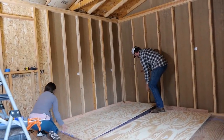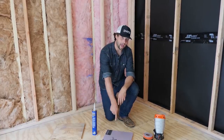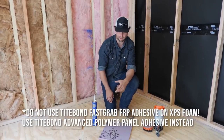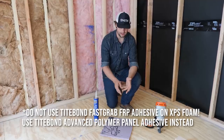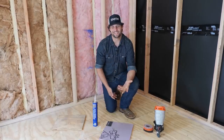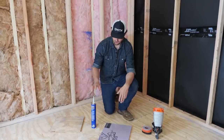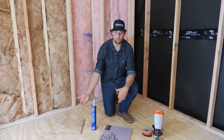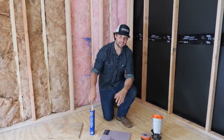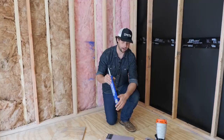That alone wouldn't be enough. You're not going to have any problems with this glue attaching to the plywood, but unless I completely coated this surface — which you can do with something called FRP glue that is meant to be troweled on for a much better bond — it's a shed, I didn't want to spend that much money. We're not getting that much foot traffic, so I'm fine with this. However, if I try to pull up this plywood, it's just going to rip the glue directly off the foam. The tensile strength of the foam is going to be lower than the tensile strength of either my plywood or my glue.